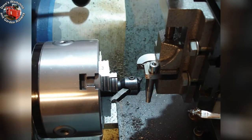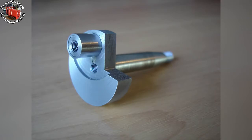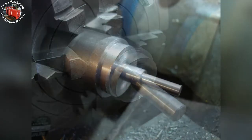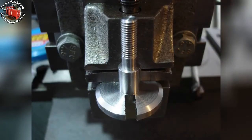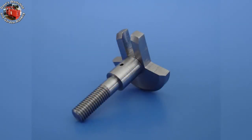Milling out the sides of the crank to make the counterweight. Generating the 15-degree angled side using my favourite step-by-step method. You can see the original, now plugged, mis-drilling just above the central hole. Milling the second side. Roughing out the camshaft follower — halfway there. Threaded 1/4-inch BSF, finish turned. The 3/16-inch driver slot has been milled. Milling out the sides to make the counterweight — milling complete and oil hole drilled. This is driven by the crank and drives the timing gears.